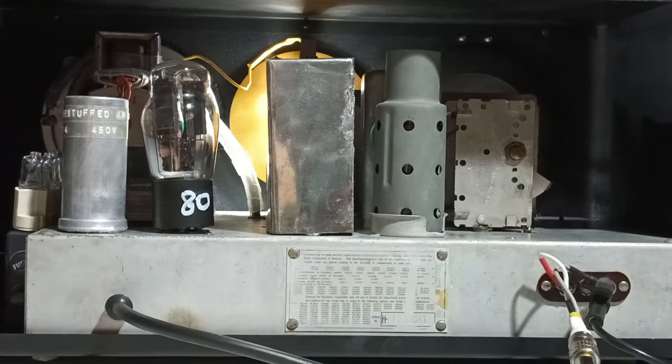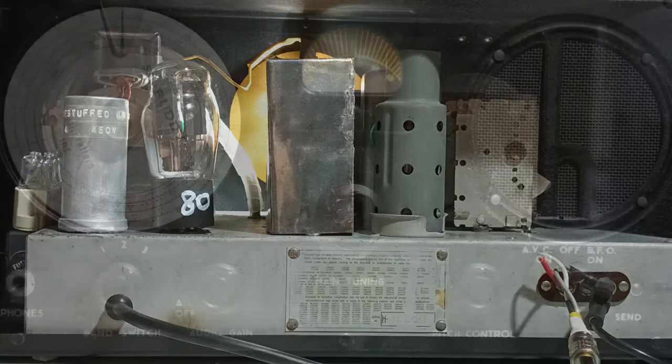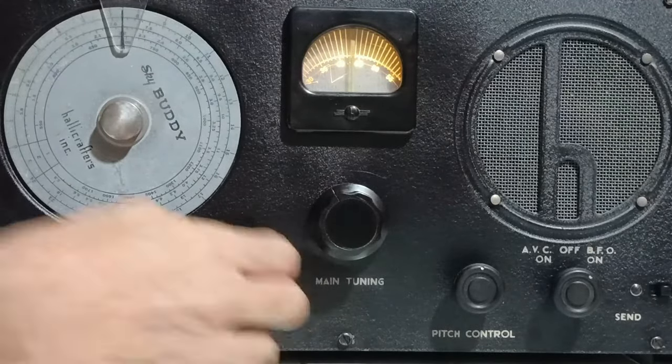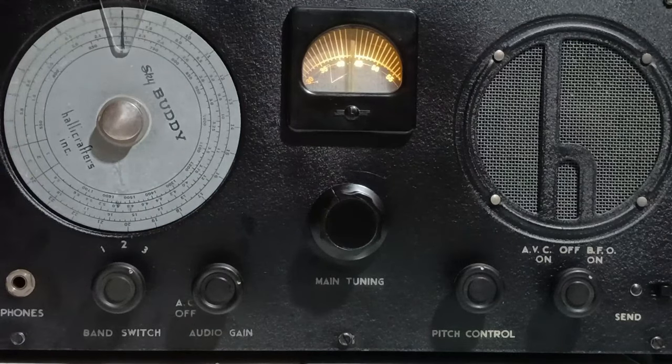At this point, the restoration could have been finished, because the hum troubles were solved and the radio was capable of working fairly well. However, the unreliability of the external dial scale movement and its difficult readability were frustrating. It seemed appropriate to add an RF buffer for allowing an external frequency counter to read the internal oscillator frequency.